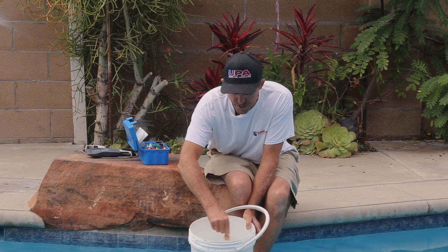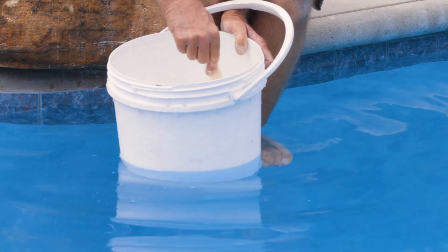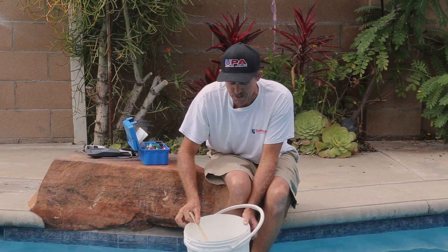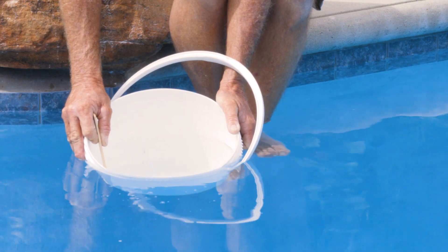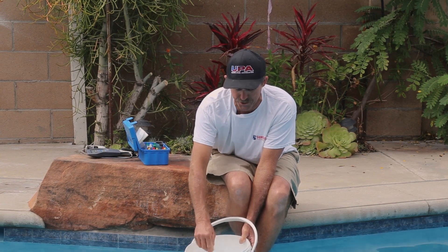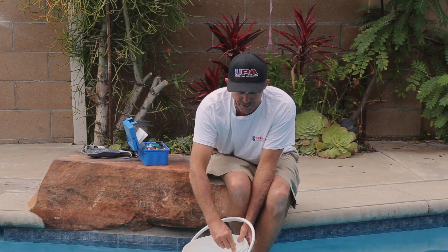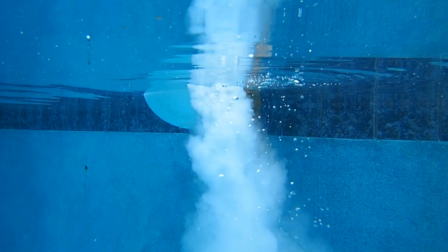So now I'm going to stir this up and make sure all the calcium flakes are dissolved. That calcium is settling at the bottom of the pool because any type of chemical is heavier than water. As the water comes back into the bucket, I still see some calcium flakes that haven't dissolved. I do not want to let them hit the surface because they will attach — they'll eventually dissolve, but they'll leave some remnants if they attach. So it's very key to stir this stuff up, get your stick in front of it, and add more calcium going into the water.